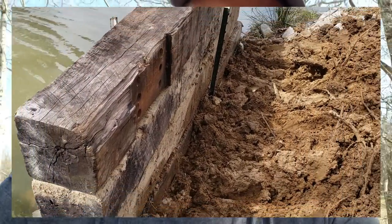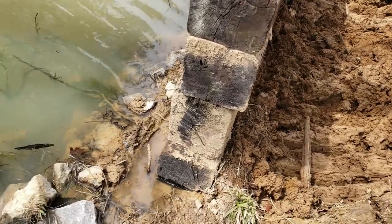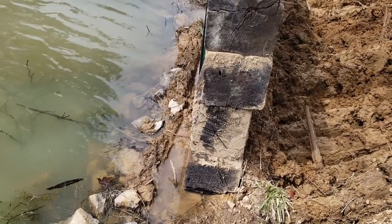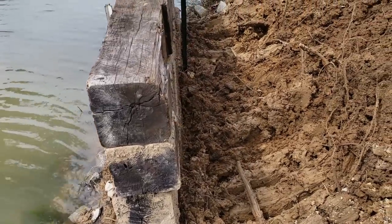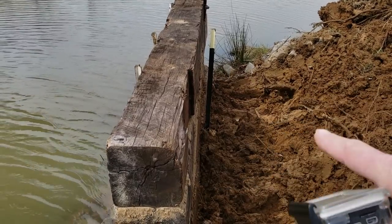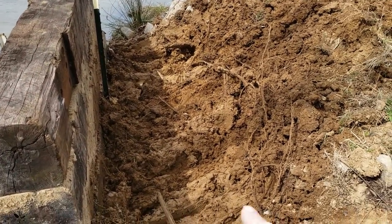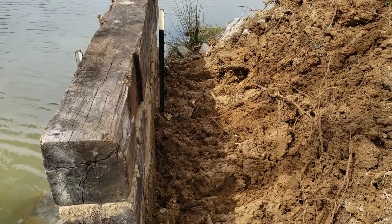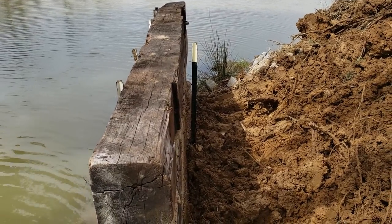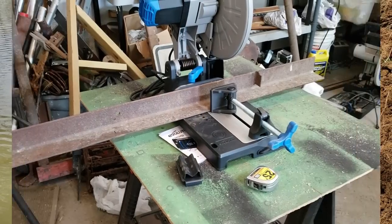My current plan is first of all I'm gonna bolt all four together. Since it's right on the edge of the water — the water is higher than full right now with all the rain, so it's only going to go down from here — I'm gonna bolt them together, lift this thing up, keep these T-posts in place, maybe sink some more steel ones temporarily, get some gravel underneath it, make a gravel pad, set it back down, then make a dead man or two back this way.